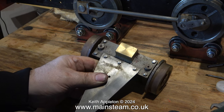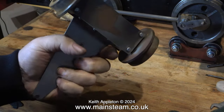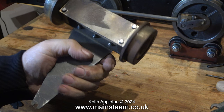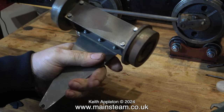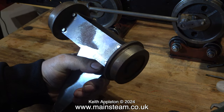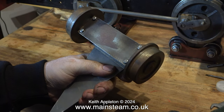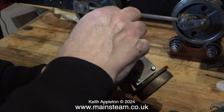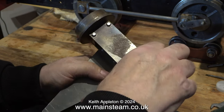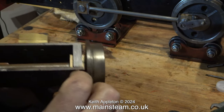All I really need to do is clean the wheels and all the metal parts and rough them up for painting. One area of concern is the damage just by the pivot. I'm either going to use my MIG welder to build up the metal that's been damaged, but before I do anything I want to look at the drawing — I can't see this being right. It's just steel against a steel pin and it's a main bearing for a part that moves. I might remake this part slightly larger and fit a bush, but I'll look at the drawing first.